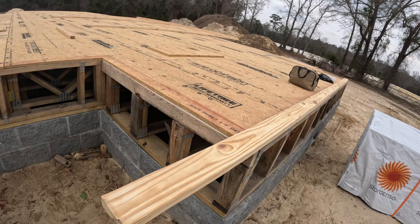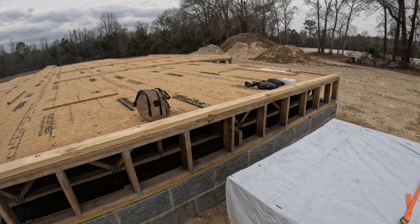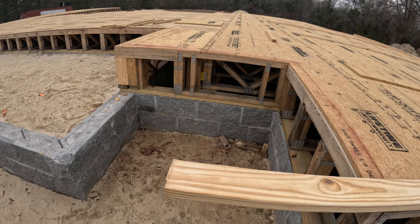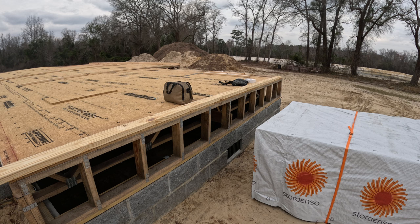And as I said, how I do a double stud is, these are 16 footers, so if I'm using the entire length, I actually cut it to 16 feet so that I have a bearing. Exactly, the stud will fall right at the end, and then the next one starts at the end of the second plate that continues it down. Like on this wall, this is only 15 or 15 and a half feet, whatever it is. So that's going to get cut off, so you only have to square one side.